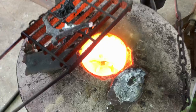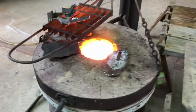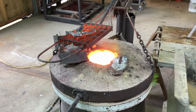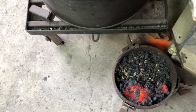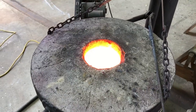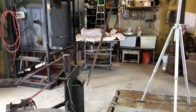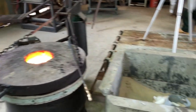This is maximum temperature — no more yellow or orange flame, just white on the inside. Most of the bronze has been put in the crucible; as it melts down I'll put the rest in. I scoop off the impurities from the top and put them in this little waste basket. The crucible is full, the bronze is up to about 2200 degrees — I have a little infrared gun I can shoot it with. I'm going to turn the flame down a little so it doesn't overheat, then go get the mold, put it in the sand pit, and pour.